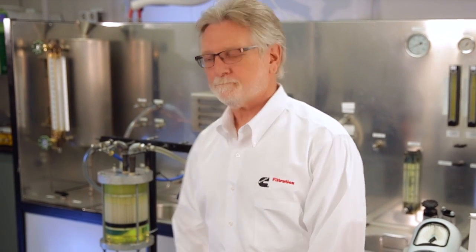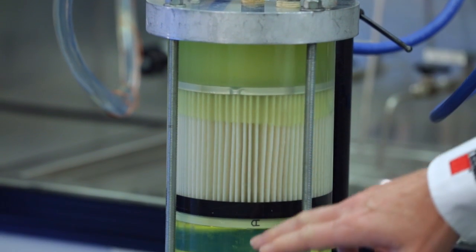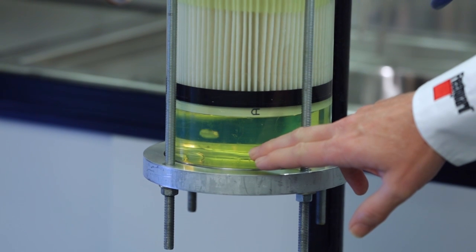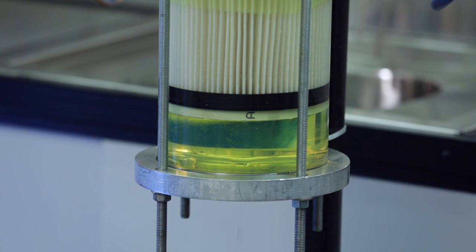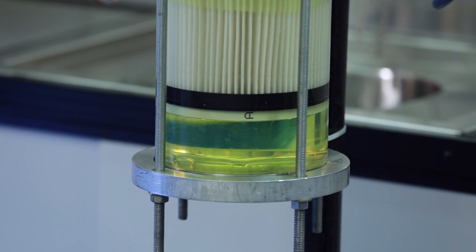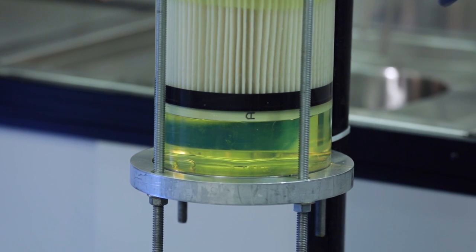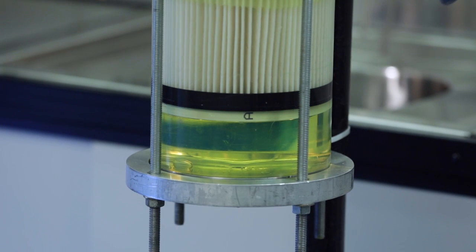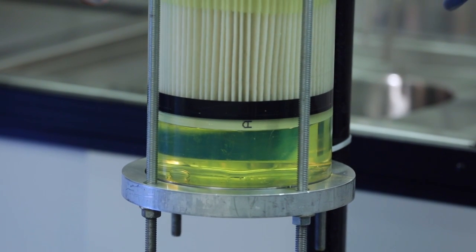Now let's further zoom in to the incoming fuel and water mixture hose, then to the filter housing inlet, then to the water collection chamber at the bottom of the housing. The bottom chamber is situated in between stages two and three of the water removal unit — this is where the separated water is collected. The water removal is accomplished by coalescing, or joining together, the tiny water droplets into larger water droplets. This occurs in the first two filter stages, and then the larger droplets are repelled by the third stage, which is a water barrier. As the third stage repels the large water droplets, you can see them fall to the bottom of the unit.